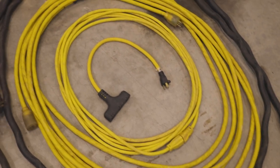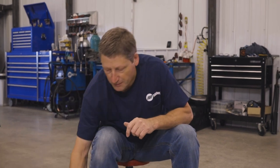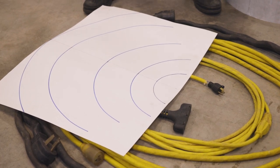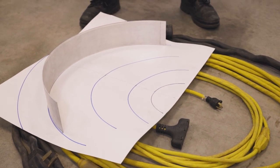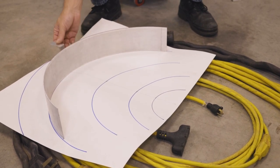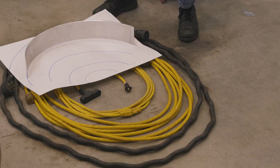I've laid out my extension cords on the floor and I'm going to be putting them inside of each other. I took a piece of construction paper and drew some radius cuts on it. I'm going to make shelves that are four inches wide and weld them to a back plate. On the shelves I'm going to weld little divider tabs, which will allow me to stack extension cords without them getting tangled. When I'm done I should be able to fit at least a dozen extension cords in the same footprint.